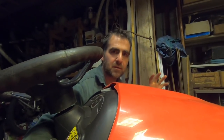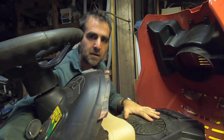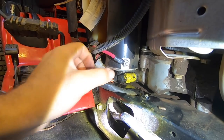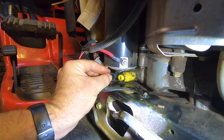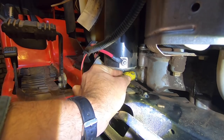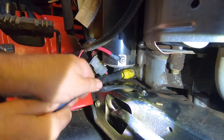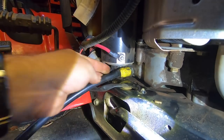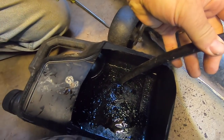One thing I absolutely love about this machine is the ease of service. It is so well designed. Down in the engine bay here, you don't need a single tool to do a standard service. Changing the oil without a tool is really easy. All you have to do is flick the black cap underneath the starter motor, twist this yellow piece of plastic, attach a bit of 13 mil irrigation tube to it, and then pull out, and the oil starts to drain.